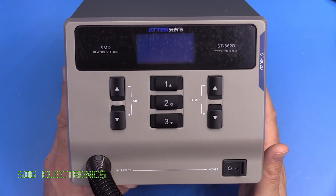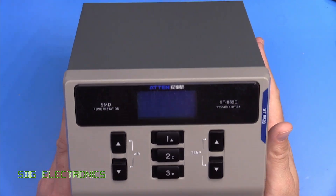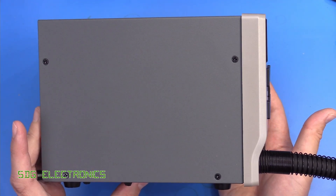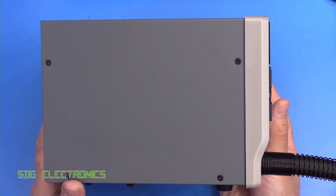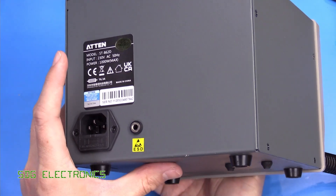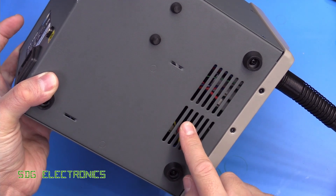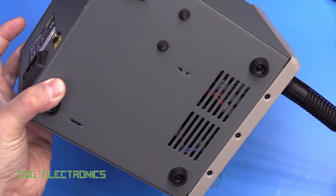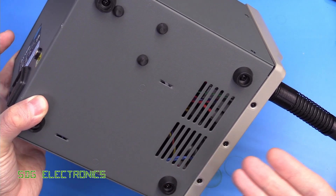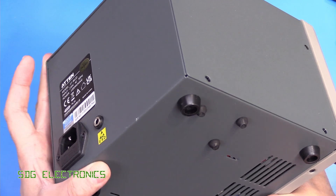The main unit is a completely different form factor to most Chinese stations. This one has flat sides, which is quite convenient — you could place other equipment above or below it, and it's really quite shallow, so it suits a small workbench. It's made from folded sheet steel. One thing I've noticed is it only has the air vent on the bottom, which might mean it picks up dust off your workbench rather than drawing air from the back like most other units — potentially a poor design choice.